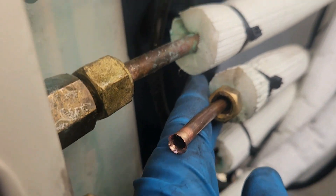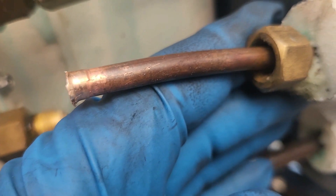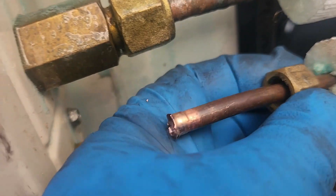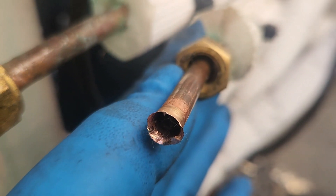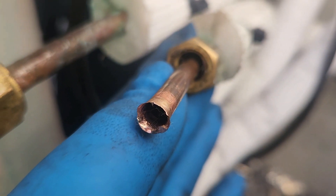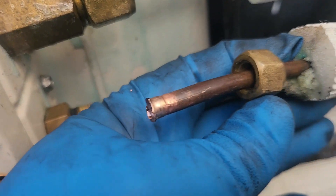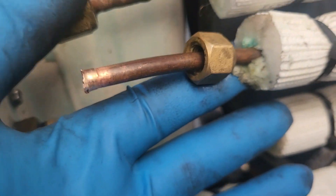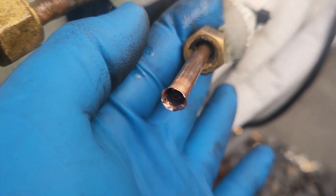On this episode of 'flares gone bad' — that's what a bad flare looks like. It actually pulled it back out. Here's the flare nut, and that's the face of the flare — it's pretty awful. Luckily it didn't blow out; we were able to do a pump down and save what was left of the refrigerant. That's what can happen.